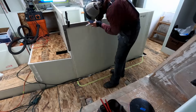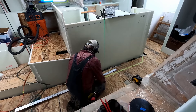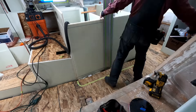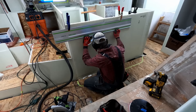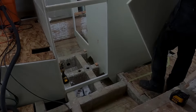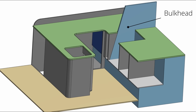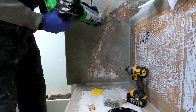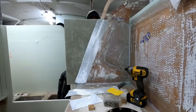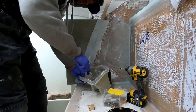While building the cabinet boxes on the outboard side I realized I was short one piece of flat stock to build the last box. I needed to cut out a section of the cabinet anyway - the outside of the blind corner where I'm going to build a large bank of drawers - so I cut out the area to avoid laminating another piece of foam. The bulkhead that splits the water tank in half is where I had the leak; it's being integrated into the galley cabinetry as one side of a box. I templated it, cut out the additional piece, glued it into the existing bulkhead, and laminated it in place.